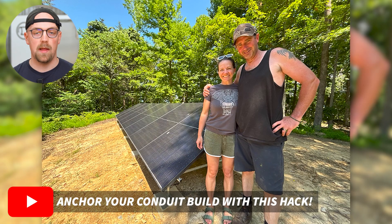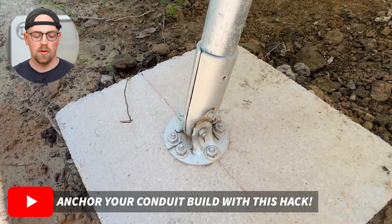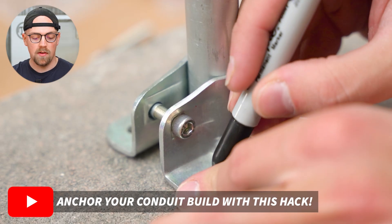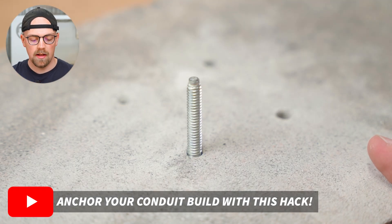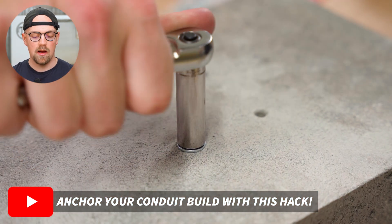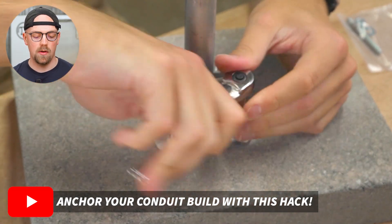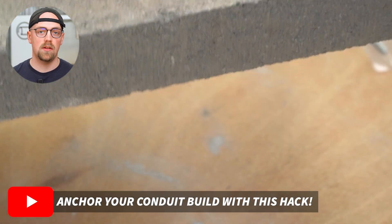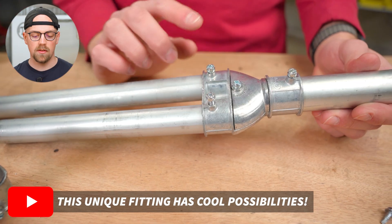This is another awesome one from the community. Meg and John built a solar panel stand with concrete footers at the base, bolting the verticals to concrete pavers using TruBolt Redhead wedge anchors. You drill holes into the concrete, hammer in the anchor, and tighten it down — it expands inside the concrete to secure the stud. It wasn't complicated at all; the footage in the video is me doing it for the first time. You can use the flange holes or thread a vertical pipe directly onto the stud.